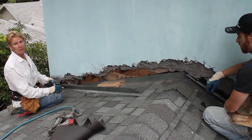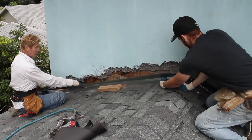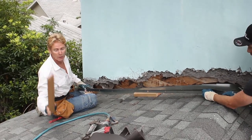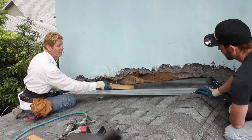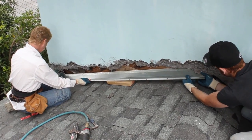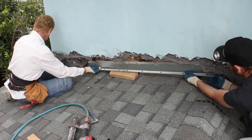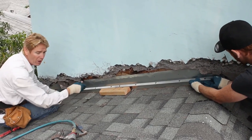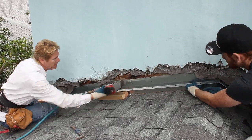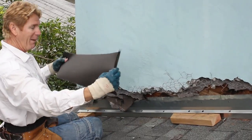Here's what I recommend: get a weep screed. What we're doing is you see the flashing here — we're counter flashing that flashing. Find yourself a template, a piece of wood. I'm just using a two-by-four and going on the lap here. Now Dan, grab that one side, go up under there. You want to go under the existing paper. What happens if you have no existing paper? Well, you are in trouble — you have to have existing paper right where you want to be. I'll put a staple here, I'll put a staple there.